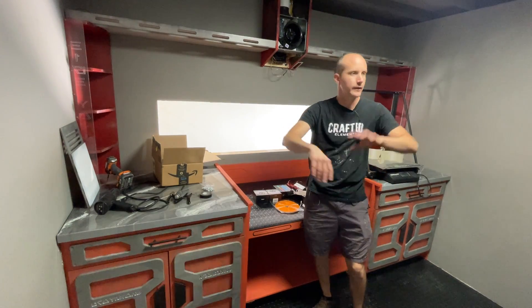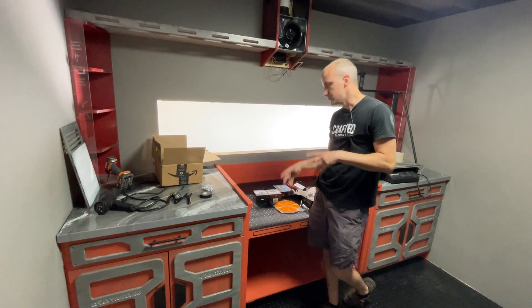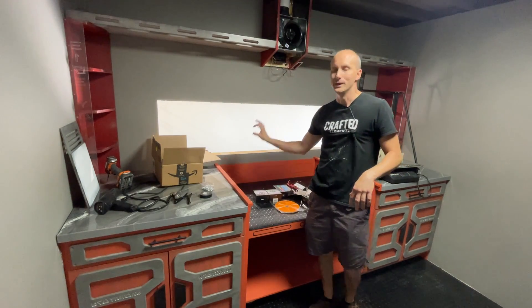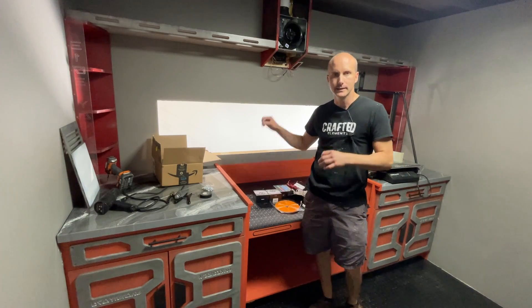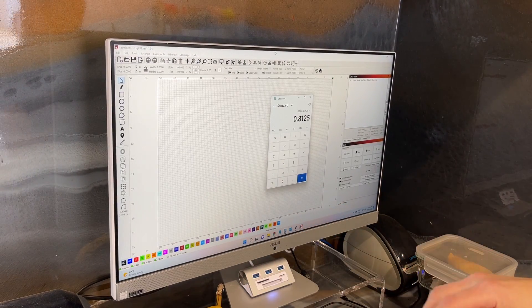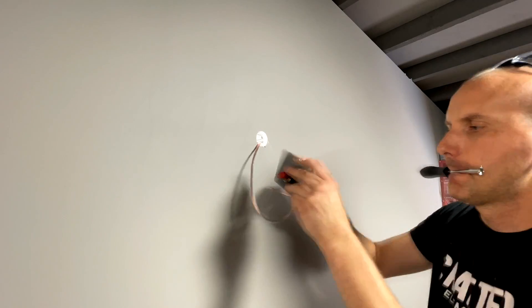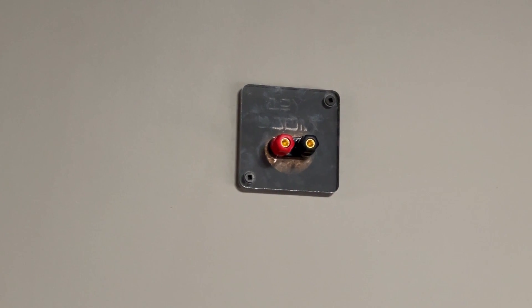That's not even the rest of the room — not this wall, not the door, not the trim. So keep that in mind. You're going to want to run your speaker wire behind walls, through the attic, behind baseboard, or under carpet — think about that in advance before you start putting all this stuff in place. Get those 12-volt low-voltage wires where you need them. I've also got little plates designed on the CNC that say '12-volt power' in Aurebesh going on the walls, so in the future I can easily plug anything else into that line without running a whole extra wire.